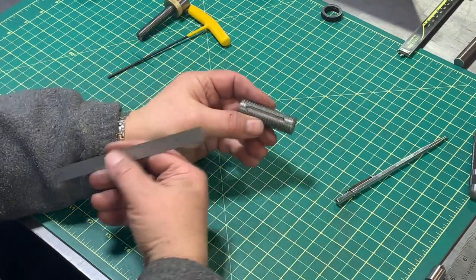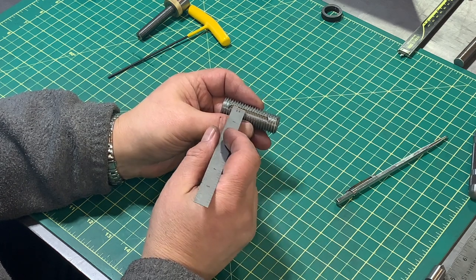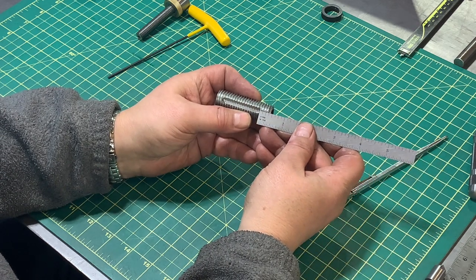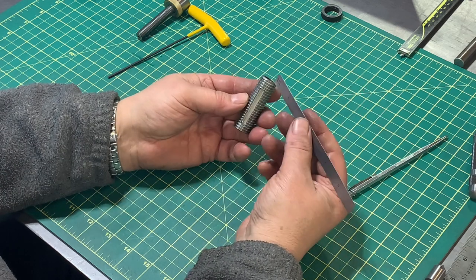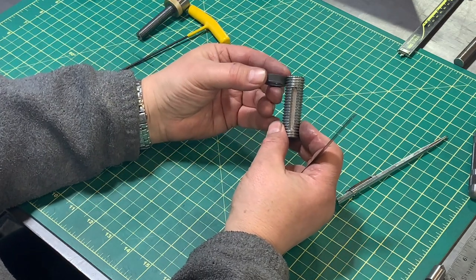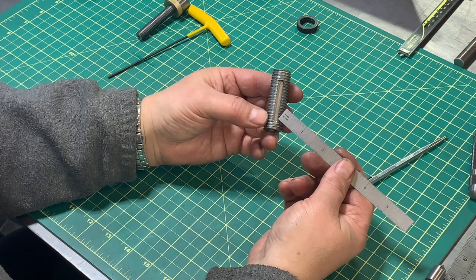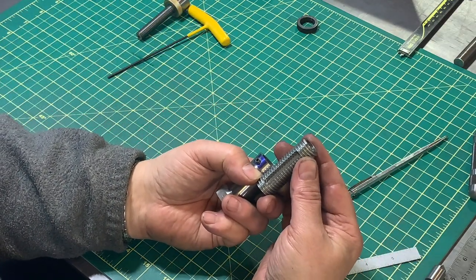Okay, so the stage one bolt needs to have a keyway set in. And this is the prototype here just to show you. But the keyway is made with a 3/16 end mill. And there's 3/8 from the top and 1/4 inch from the bottom. And that way, this allows for this nut to sit up here, which is 1/4 inch or plus. And then the bolt will not extend so far that it falls off. And that's why I chose those particular measurements.